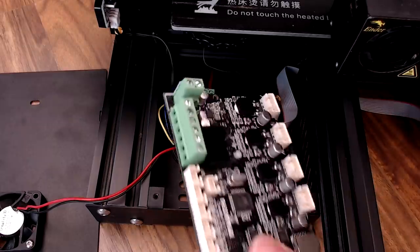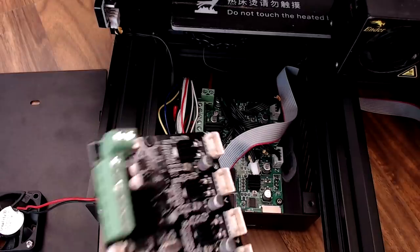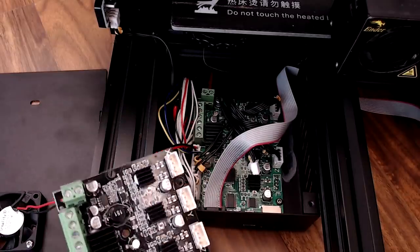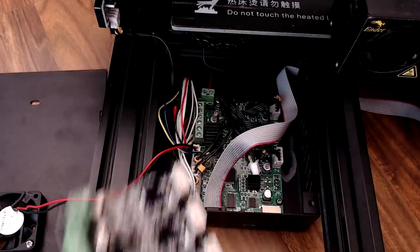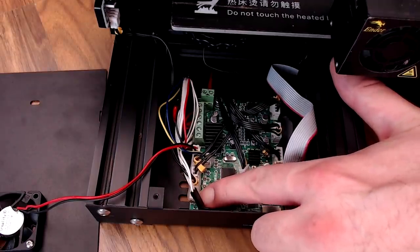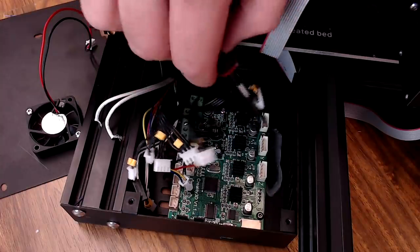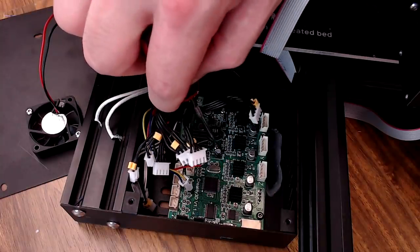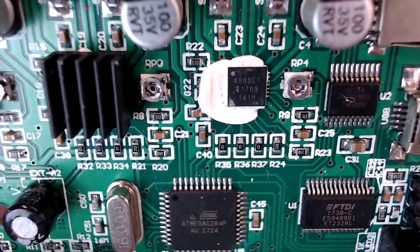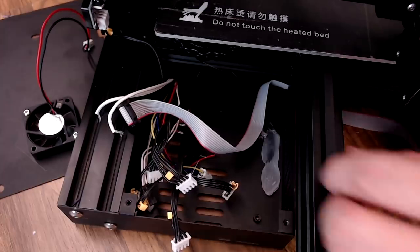You could do this one connector at a time, moving from the old board to the new board slowly, but there are some things I want to show you inside that make that method tricky. So update your documentation well, put some labels on, take some pictures, and you should be fine - it's not that complicated. Now I'm going to unplug everything from the board. There is hot glue on a lot of these connectors, but you can usually get them free with just a razor blade. With all wires off, there are four screws to remove the board. On the old board I pulled a heatsink to check the driver type - it is an A4988. This is version 1.1.2 of this board.